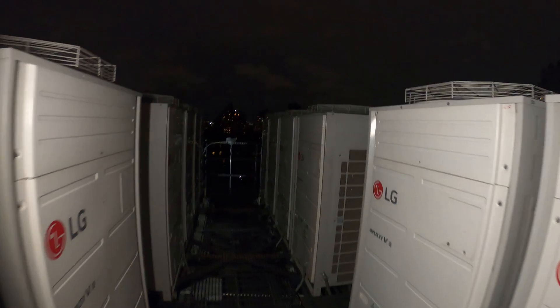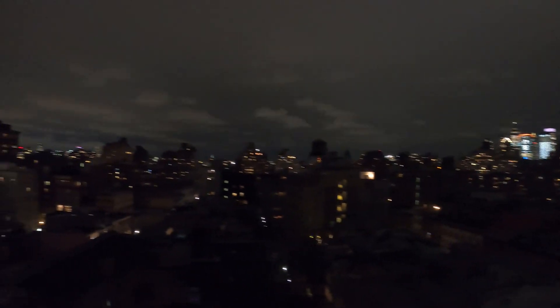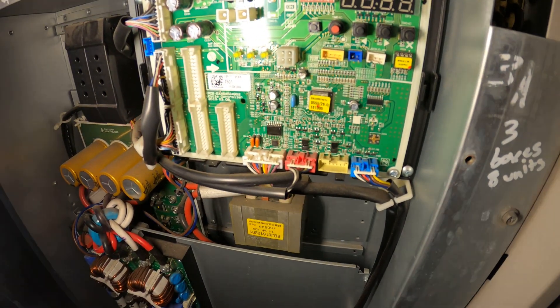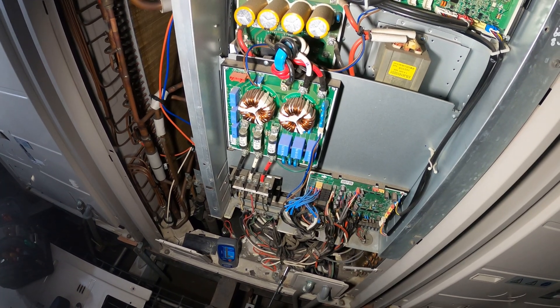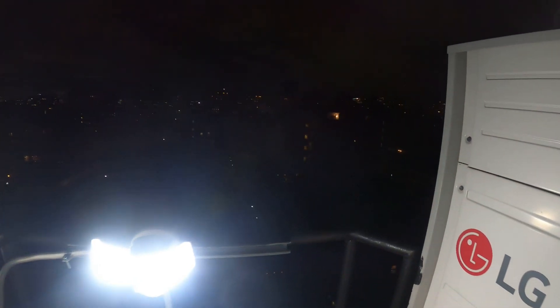There are quite a few units up here and it is a cold, cold night in New York City. We're going to wrap this one up. We've got a bad compressor and a bad inverter board. We're going to go for round two with this one. A couple of checks you may want to do: check this board with the resistance test while everything is off, and the other checks require the system to be running. Bringing this compressor up is going to be a pain — got to go all the way around. If anyone found this video interesting or helpful, please drop a like, comment, and subscribe as I come out with new videos every week. I'll catch you all next time.